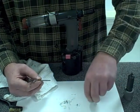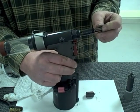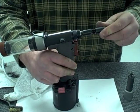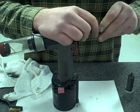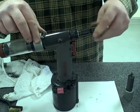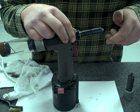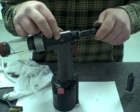Now that the jaws are greased and in place, I'm going to install the long mandrel guide tube and jaw pusher back into the tool. There's a spring force fighting against you — make sure it moves freely and clearly in the tool before assembling the jaws. I'm going to put the nose housing or jaw carrier back on. Fighting spring force, line it up — it can be a little bit tricky. Make sure it starts and screws down freely. Tighten it down until you hear a slight click.